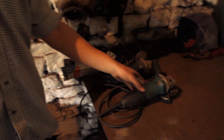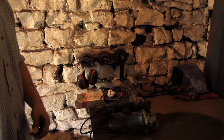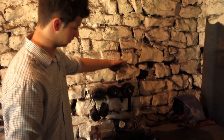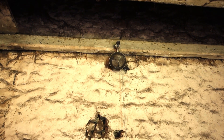In the workshop I tend to use two angle grinders: one which has a cutting disc in and another which has a grinding disc. I plug both of them in and it just saves you so much time when you don't have to keep changing the discs. Welding rods, welding mask, all of that stuff around there.